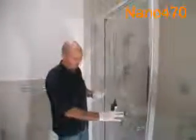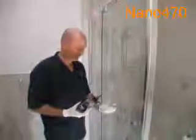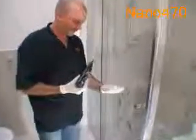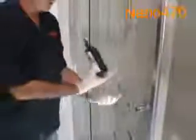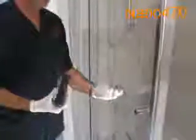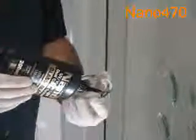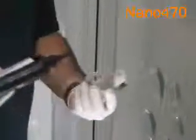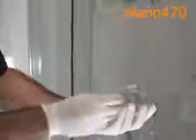So we've done up to about halfway so far. Putting the adhesive on the bevel, we start at the bottom. We're going to place the bevel in such a manner that it pivots on the bottom edge. That way we're forcing the adhesive up and over the top edge of the bevel. So we apply our adhesive on the bottom half of the circle, and we let gravity run the adhesive out through the bottom to minimise any bubbles. Once we've got half done, you may want to put a little bit at the top there, because the top's very important to get the adhesive to.